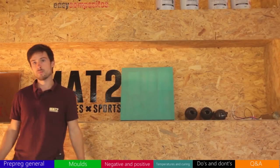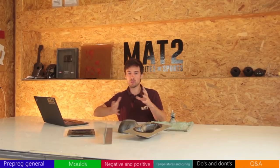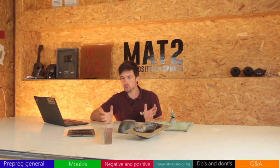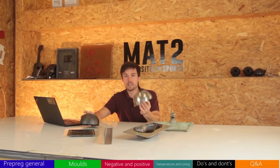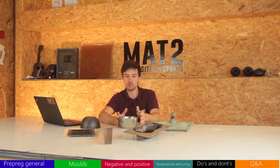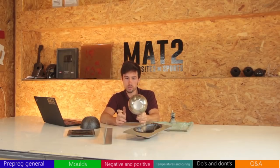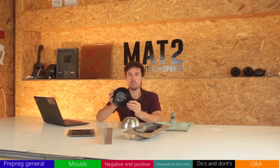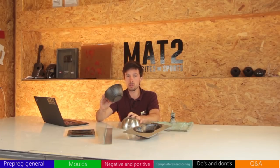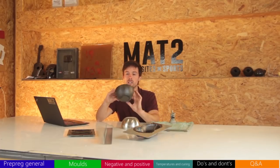If you're new to prepreg and want to start making parts like in the tutorials, some easy starting solutions: I mostly work with easy sample objects. These are aluminum IKEA salad/cereal bowls — great for testing a new prepreg or material. When the new XPreg was released I just started by making samples on these before committing to new molds. You can buy ten of these and try different layups, different curing cycles — that's how I learned to get good results from this new prepreg system.